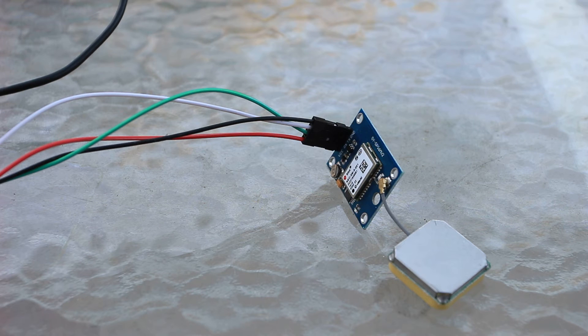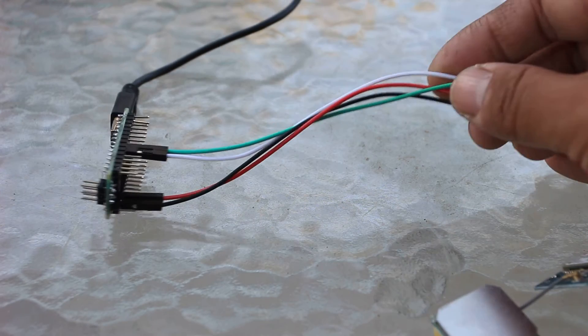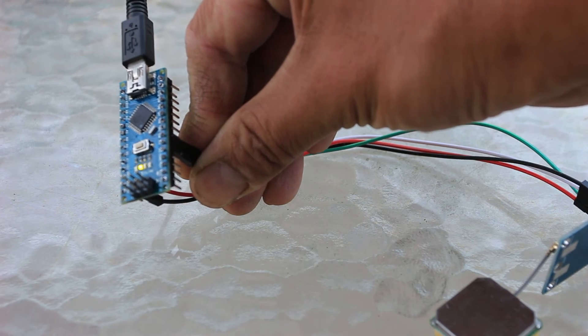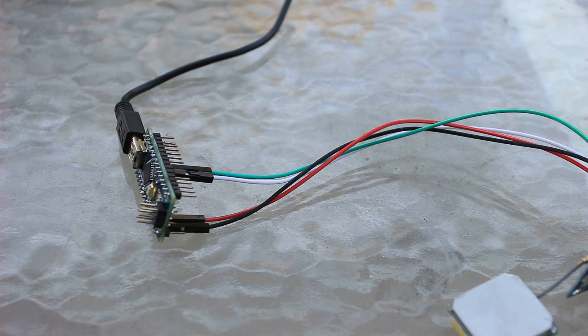The other nice thing about this is it does pull down atomic clock information from those GPS satellites, so you get very, very accurate time signals. What you see here is the Arduino running some code I wrote, which receives those serial signals. It actually uses a software serial port connected to pins three and four — that is not the built-in UART on the Arduino, that's actually a software emulation. The reason why is because I have the normal serial port connected to a computer — the computer's not doing any processing, I'm just using it as a terminal.